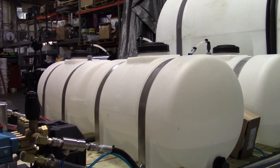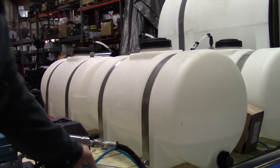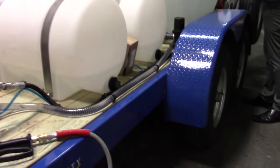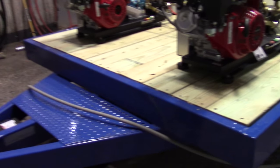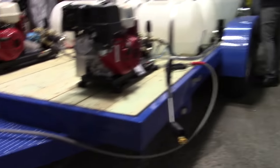We actually have four chemical tanks on this trailer — two low pH tanks indicated with a blue line. We always use blue for low pH or acidic cleaners. The red lines are your alkaline cleaners, so this customer can actually have two different soaps: maybe safe on polish for a tractor trailer with polished aluminum, or a more aggressive one for heavy duty cleaning. Typically this unit goes out with Dynaclean. We also have a 535 gallon water tank on here — a Tanamax. It's a super heavy duty trailer with 2-inch by 6-inch box tubing frame even up at the tongue, heavy duty coupler assembly, heavy duty jack assembly, and LED lights.